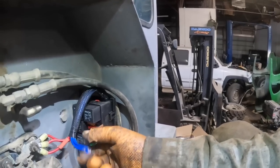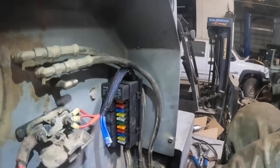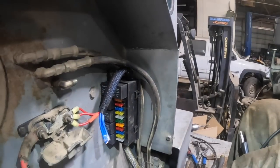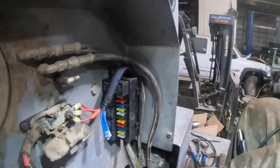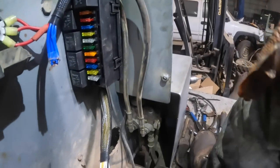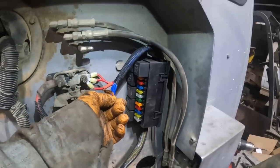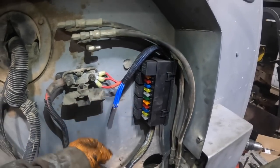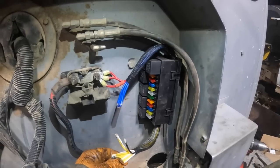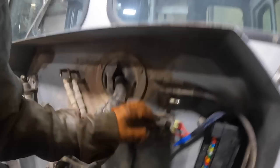I thought the relay was latching then going through the fuse, but no — it's going through the fuse and powering up pin 30 on the relay. That's kind of the way I'm understanding this. These will go out to whatever component. Looking at the Cummins wiring diagram, they're showing a battery power going into the cab with an inline 5-amp fuse going to the ignition. So should I put a wire right here and just go straight through with an inline 5-amp fuse? Or should I use one of the available slots and put a 5-amp fuse in there? That would make way more sense.